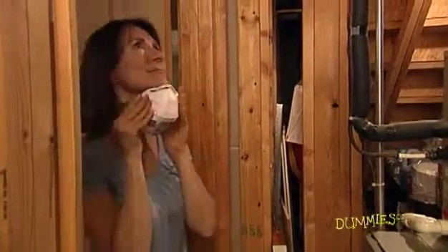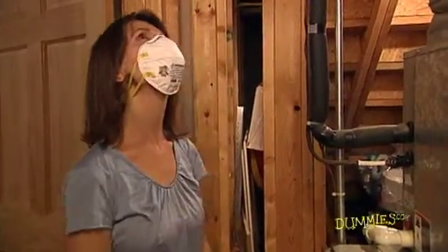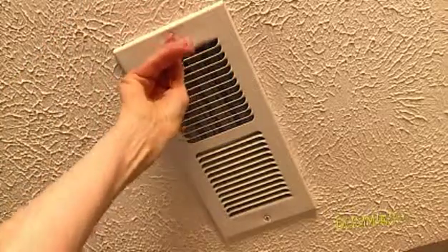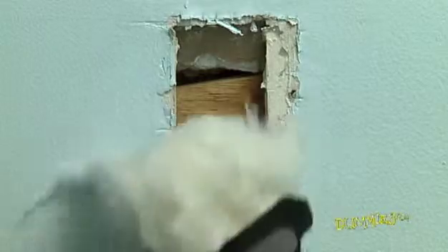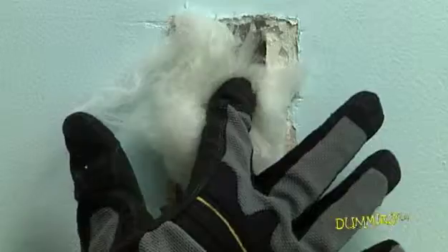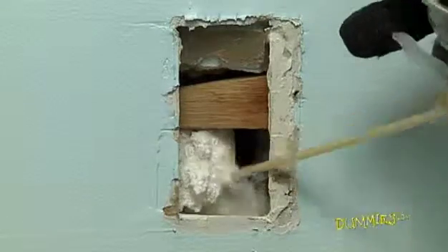When you're working around ducts, wear a dust mask — you can find them at hardware stores too. Also, close the vents leading to rooms that don't need to be cooled or warmed. Next, check the insulation wherever you can. Missing insulation is easy to deal with; it's usually missing around light fixtures and where somebody has pushed it aside to work. Fill the holes by either replacing the insulation or filling them with expandable foam insulation, which you can get at a hardware store.